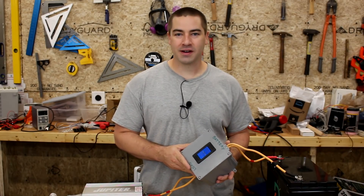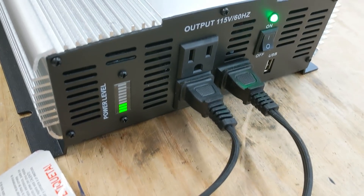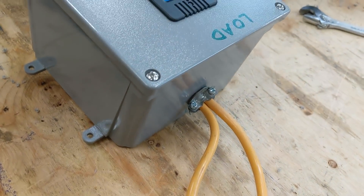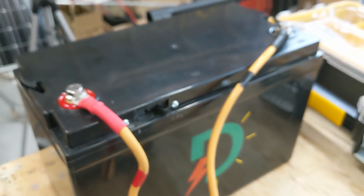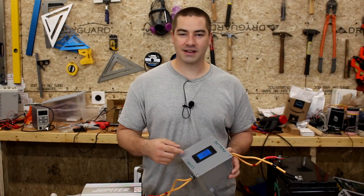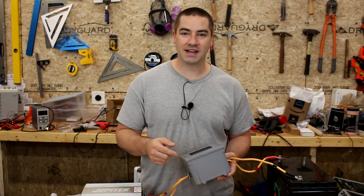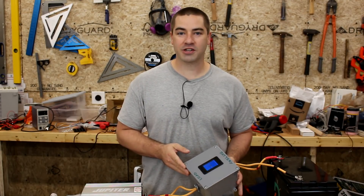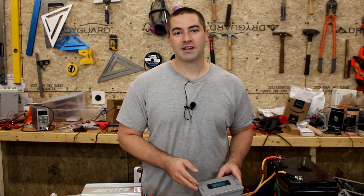I enjoyed building this meter. If I build another one in the future, a couple of changes I'd make: offset the holes in the box to allow for the shunt to be offset, change the wire length to about three feet overall, and offset the box closer to the inverter side giving more length on the battery side. You'll probably see me use this meter in upcoming videos and now you'll know what's inside the box. Thank you everybody for watching — if you enjoyed the video please like, subscribe, comment, share, and hit the bell icon to get notified when I release new videos.